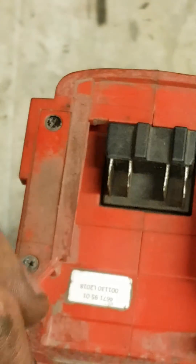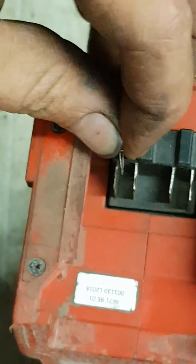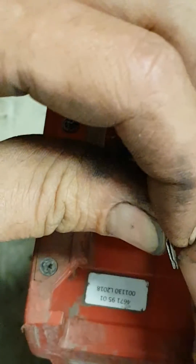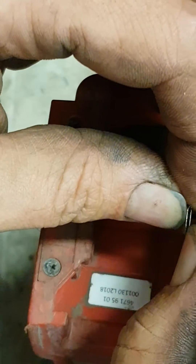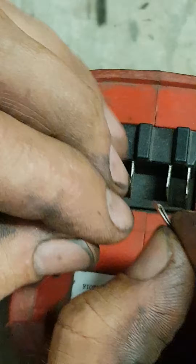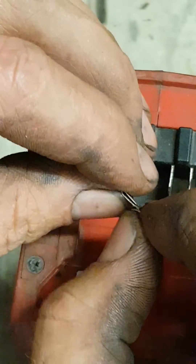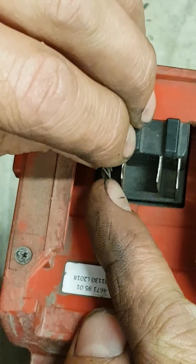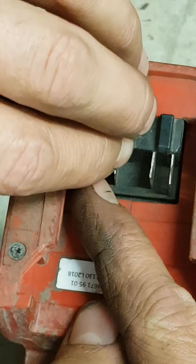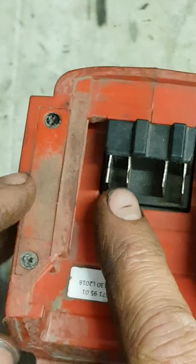I'm just using an old scrap battery here, so I'll put a bit of this here — a nickel strip from the bad battery is what I'm using. You want to cut a wee wedge shaped like that and just hammer it flat. Put a wee piece like a feeler gauge onto that there and hammer it to get to the right gap. Then hook that over the contact.